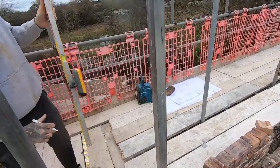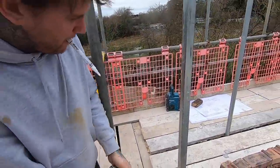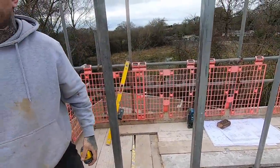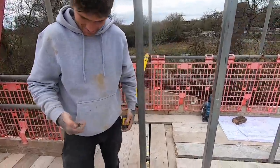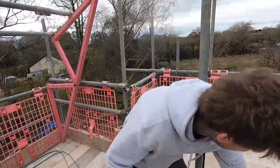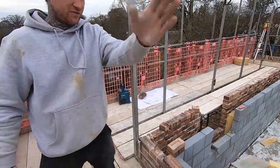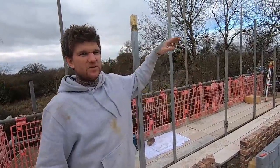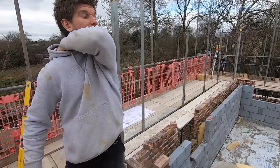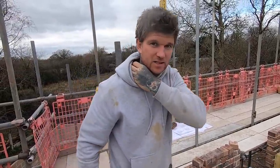Alright, let's see what we've got today. We've got 750. How many courses is that, Tom? 10. Well done! It's the easiest one to remember. So we've got 10 courses up to here, and then we've got three courses over the top of that. So we've got 13 courses in all through this flank. This is a gable end, so that can go a little bit higher. And the back, I don't know the heights. 13 courses through here, so I know what to load out. And Amy just needs a hand.